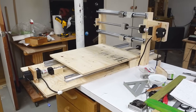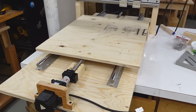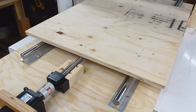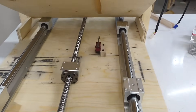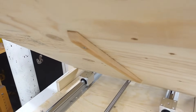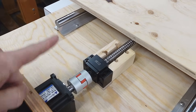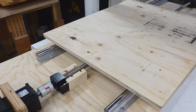I'm feeling a bit meh about progress on this machine, so I figured it'd be fun to at least get one axis moving with its motor. But these motors are really fast and really powerful, so I've got to protect the machine against accidents. For starters, I've installed a limit switch down here that runs along this rail, so when it runs off the end of the rail, that will disable the motor. But because these motors can go at 3000 RPM, the whole thing might still have a little bit of inertia even after it passes the stop.